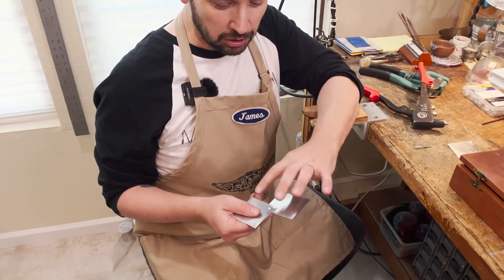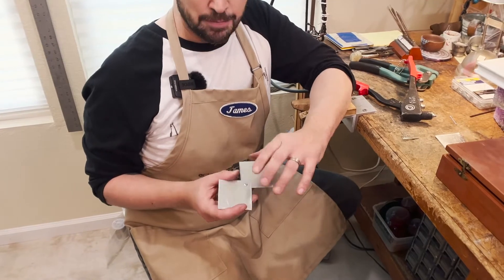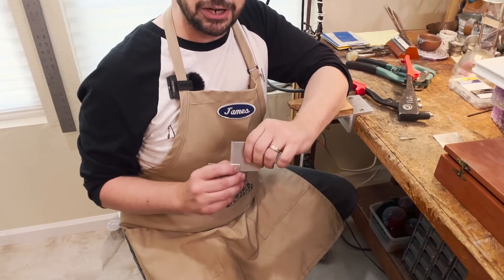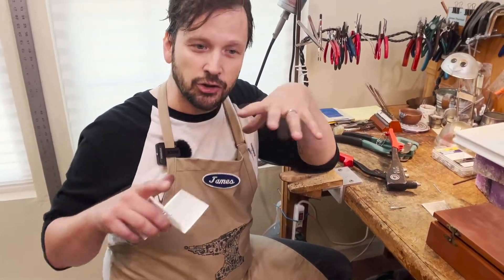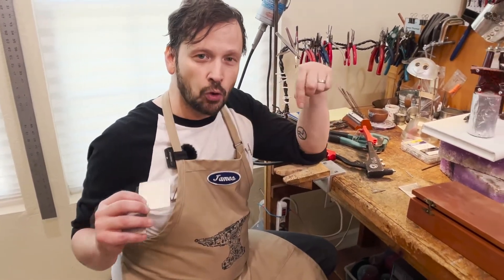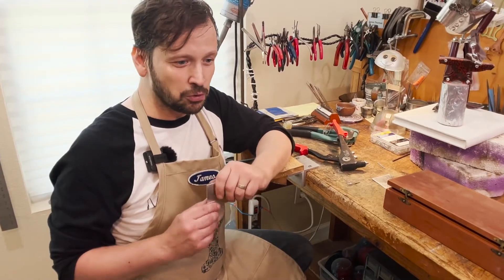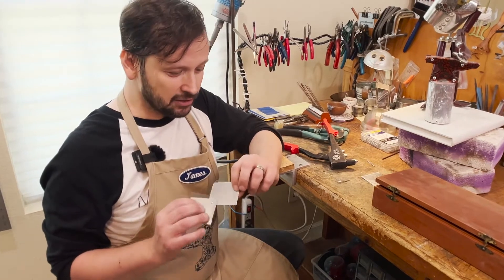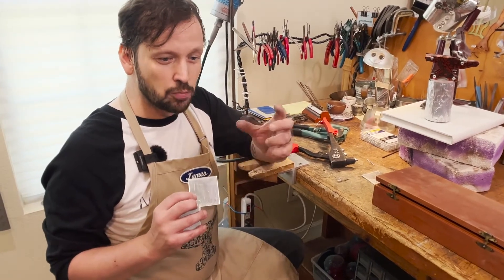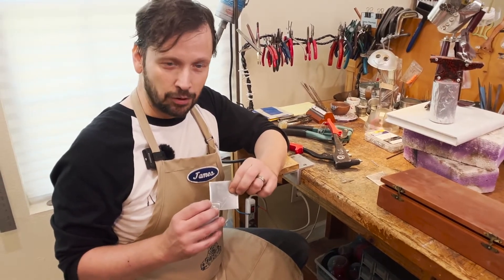If you're trying to line up a whole bunch of rivets on a piece — a great friend of mine was building his own one-person airplane, and if you imagine airplane wings with hundreds of rivets, you need to line up all those holes in the materials and can't have it shift, which is really tricky. He made me aware of this tool I had never heard of called a Cleco — C-L-E-C-O — and what it does is act like a removable pop rivet that can go into your material and temporarily hold it in place.